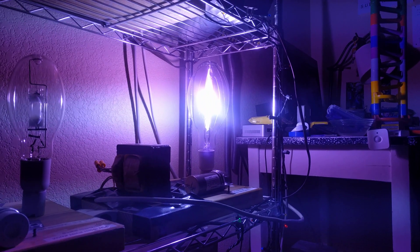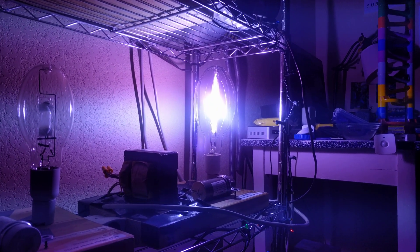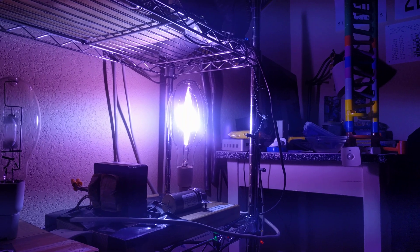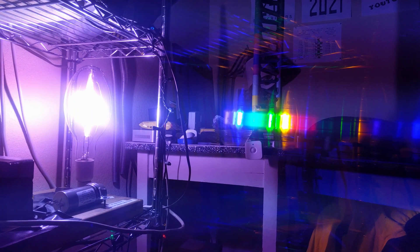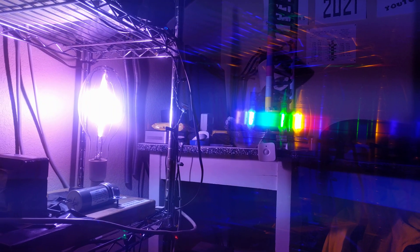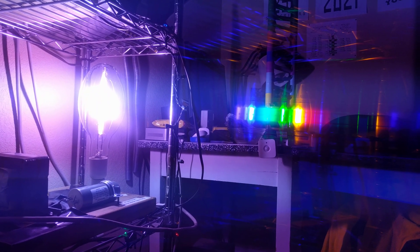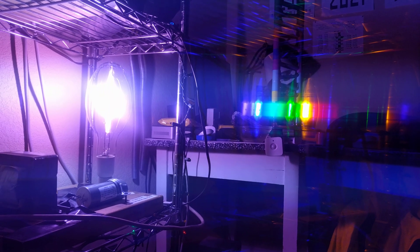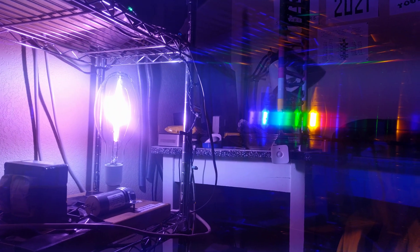We are back and the lamp is at full brightness now. You can see it's really bright because of the wavelengths on the camera. You can see a little bit of violet from the UV rays, a little bit of blue, some green because of the mercury vapor, and some orange and red because of the sodium and lithium. That is what the spectrum of this magenta metal halide lamp looks like.